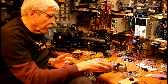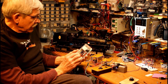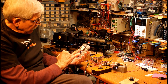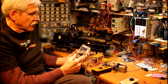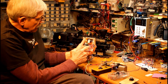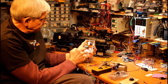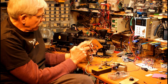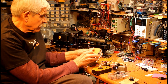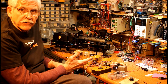Here's another throttle that I built. This one happens to be in a clear acrylic case. You can see inside it there's an Arduino Pro Mini, the joystick, a battery up here from a cell phone, and the radio module that does the transmitting and receiving. Inside each of the receivers — I can open that up — you've got the three LEDs, a motor control board from IC Station, the transmitter-receiver module, the Arduino, and a little bit of hand wiring that's explained on my webpage. I think you could duplicate this pretty easily, not very expensively — maybe $100 worth of parts for all four pieces: the throttle and three receivers. You don't need to have three receivers; you could work with just one or two.